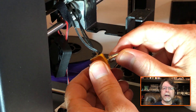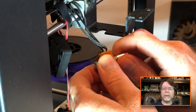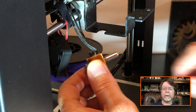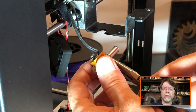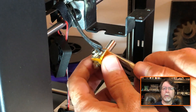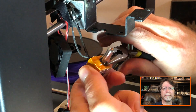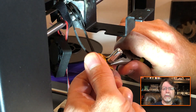That's the new heat tube — start threading it in by hand. If you run into a little resistance because the threads in your heater block are gunked up, you might need to heat the block up by doing a filament load cycle again and then tightening the tube down with a needle-nose pliers. You'll want to hold the block with a crescent wrench because it's going to be really hot — don't burn yourself. Get the tube tightened down and then we can proceed further.